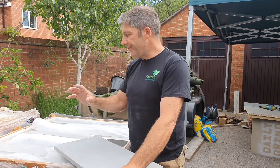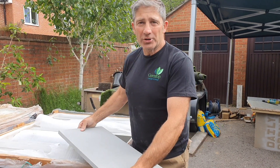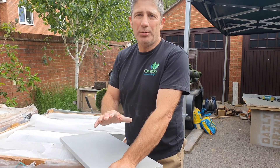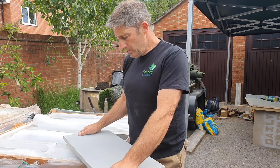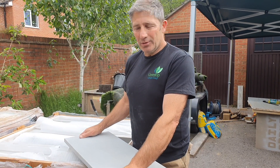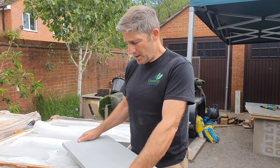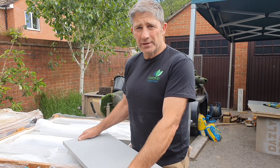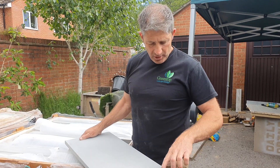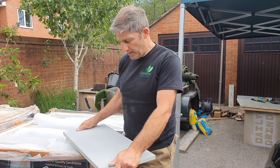This project pack comes in four different sizes: a 2x1, which is this one here, a 3x2, a 2x2 and a 1x1 - so it's a real mixed bag of sizes. Don't let that put you off. As long as you avoid cross joints - where slabs join on four corners - it will look better. Just mix up the sizes and avoid straight cross joints; people say it's a weak point as well, and it does look better when avoided.